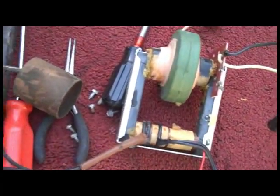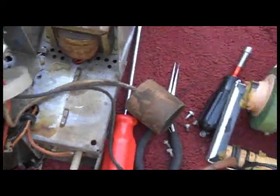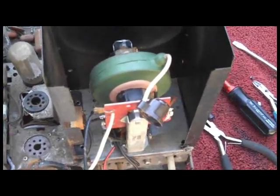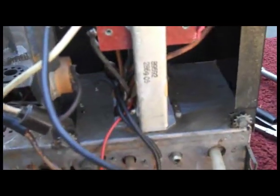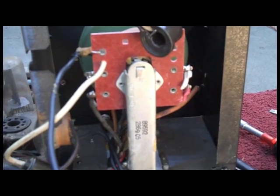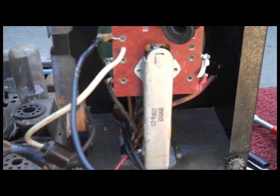The next step is to mount the transformer. One wire remains on the transformer that has to be pulled through a hole and soldered underneath. Back mounted in the cage, the flyback fits perfectly — all the screw holes line up and all the tabs fit into place. It's going to be pulled a little tight, but all the existing wires do appear to reach the contacts on the new flyback.